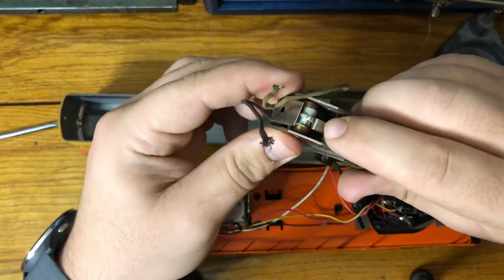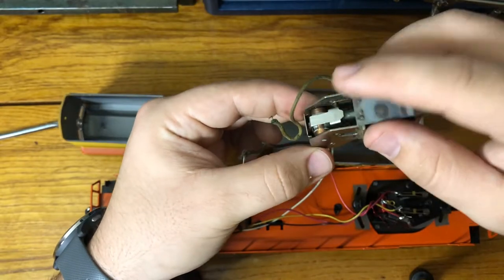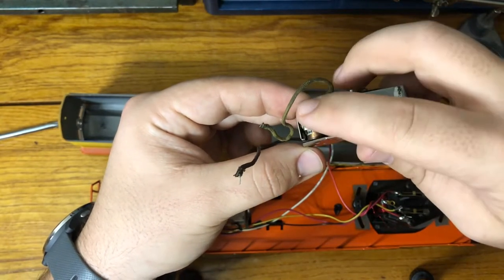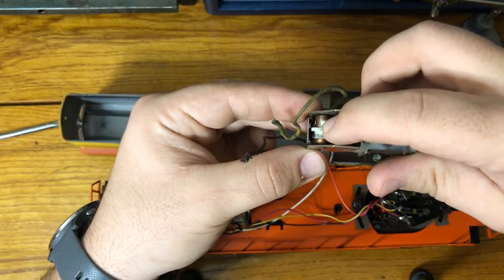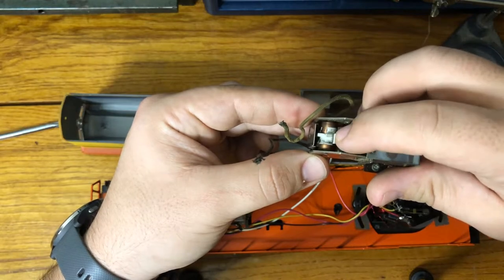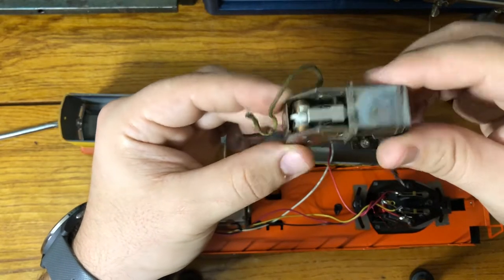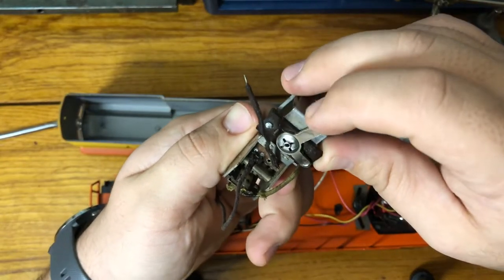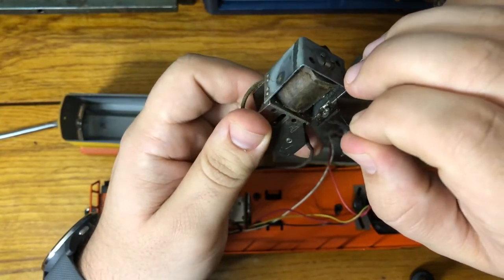And this arm here works on gravity. When the electromagnet isn't applied, it's actually staying low here. Then the magnet's pulled in, and that pulls this wheel to change a direction like that. So just a simple explanation. I'm just a hobbyist, like I've said. This is just my basic understanding of how they work.